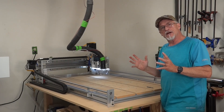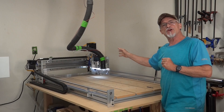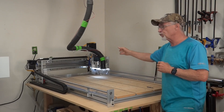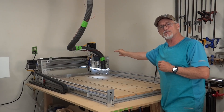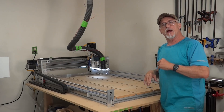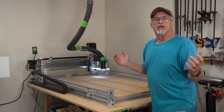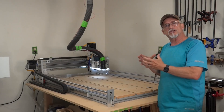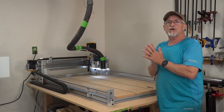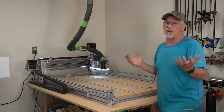Make sure that if you're going to buy a CNC machine, you can put in a larger router — whether it's a spindle or a standalone router. The reason I put in a Bosch three-horsepower router is because if that router fails, I can go down to a big box store, buy another one, pop it in, and be back up and running in half a day. Compare that to a variable-speed spindle — they're very nice and a lot quieter, but you don't have that availability. Standalone routers are also quite a bit cheaper.